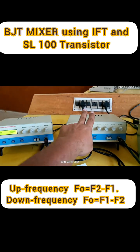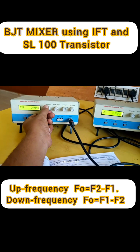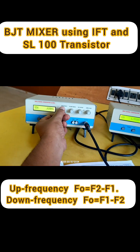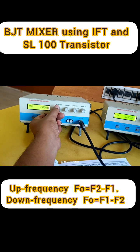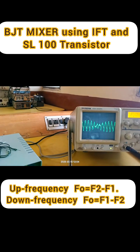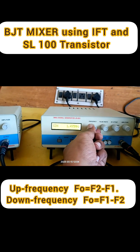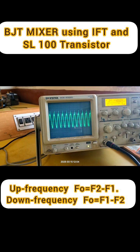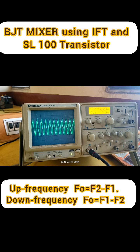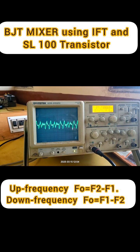You can observe whatever you get here — some sine wave, that is the mixing of signals. I will move out from this tuning, keep this at 1 MHz, then go to 1.5. Coming back, I am varying this and getting a correct part of a sine wave for 495. We tuned it for 490, so around 490 you will get a proper sine wave — this is what the tuning and IFT mixing is.